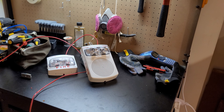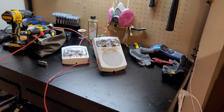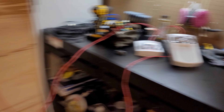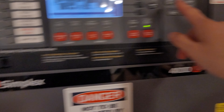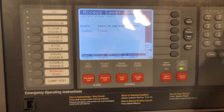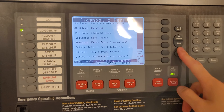That's all through this pair of wires — this one's for our audio going to the amplifier, and this one's for our strobes and horn strobes or whatever IDNAC device you have. True IDNAC devices do work, as do these pre-IDNAC devices. These look like normal TrueAlerts but they're not — they have an addressable LED in there. I'll show that in a future video.